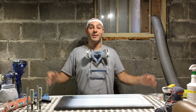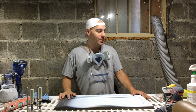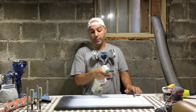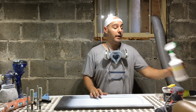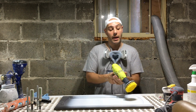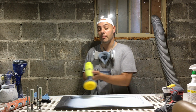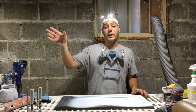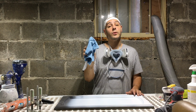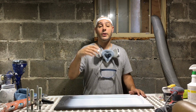So today we're going to cover the process of, hey Tino, how do you refinish my cabinets? So here it goes. The first step is very important. It is the cleaning process. I like a good degreaser. So Spray 9 or TSP are fantastic. We spray the cabinet doors down really well. And then hey, I love power tools. So we've got these great spin brushes that attach to our drills. And we power scrub your doors down really well, both sides, and then it's on to rinsing them with some clean water. And this is all done over in my washing station. So clean water and some clean microfiber cloths. We wipe them all down and we let them dry.